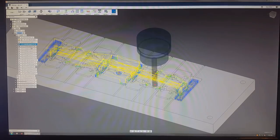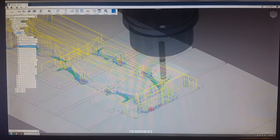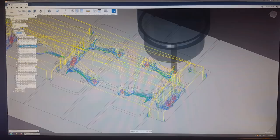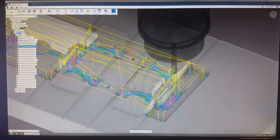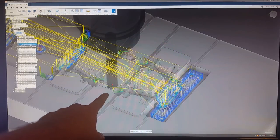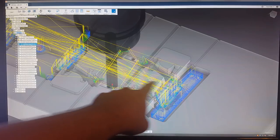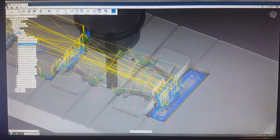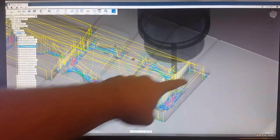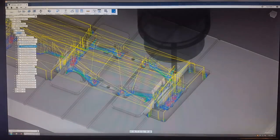And then I slowly step down between like 1/4 inch, and then here I'm going down to a 1/8 inch end mill. What's also nice is that Fusion 360 looks at all the previous operations. Like this, for example, is a 1/4 inch. You can see it machines this pocket, but the 1/4 inch radius can't quite fit in there. So when I do an eighth inch toolpath, it will come in and just clean up what the previous toolpaths could not reach, which is pretty cool.